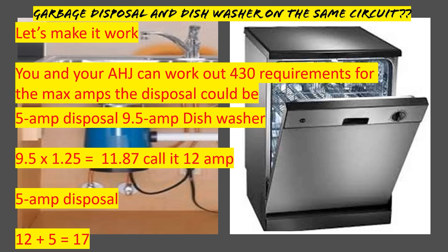After working through all this in the series, I was originally hardcore about pulling one circuit, but I've had a couple of buddies get burned by the dishwasher being too large and having to pull a second circuit in a finished home — after the rough-in, on the final. One situation was where they were missing that circuit and pulling off the kitchen circuit, which you cannot do. So after working through this series and reading through Article 430, maybe pull another circuit. It's not always worth the stress — sometimes it's just not worth the cortisol release for the $200 it costs to pull another circuit.